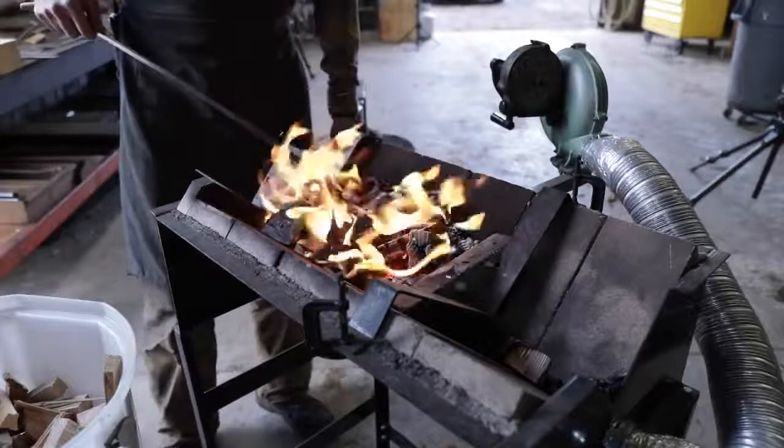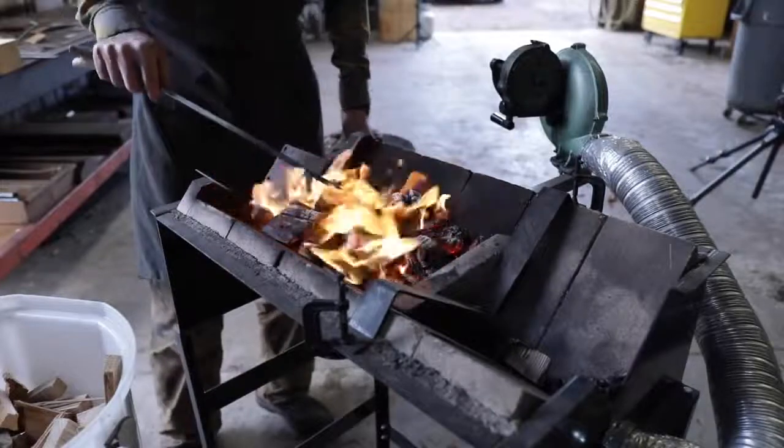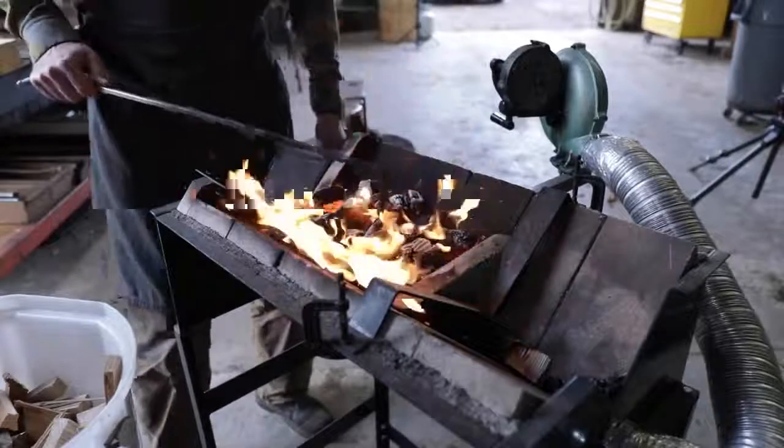So this is my forge. This is something you may not have seen anything like before. These are actually built by the Whitlocks family in Oregon — I met them some years ago and I got one from them. You're probably familiar with propane or coal — those have traditionally been the best way. But out west, years ago, a lot of smiths would forge with wood because that's what was readily available, and I'm kind of partial to it. It's not as hot as the other ones and it takes a little bit more caretaking to keep it going. But after about an hour or so of tending the fire and using the blower, you build up a nice base of coals, and it seems to work really good.